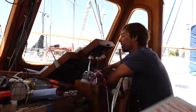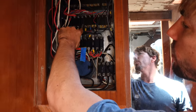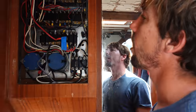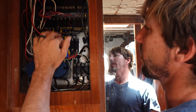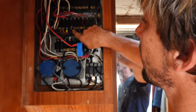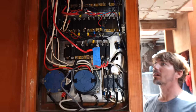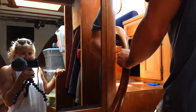Another thing that's really far off — this one is the fuse. It was hooked up wrong. I think it was like hot-wired straight to the other terminal or something like that. It was hooked up wrong and that's why I disconnected it. And again, more stuff is hooked up wrong back here too. Like we shouldn't have this stuff — they have all these little jumper cables across, which I don't know what the rule is with that, but ideally it's just these metal strips that connect the whole hot side. A bunch of things to be cleaned up, and still trying to identify and fix the autopilot.